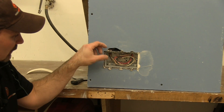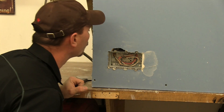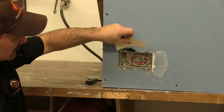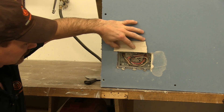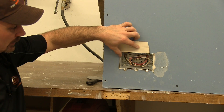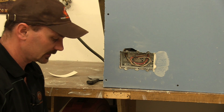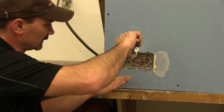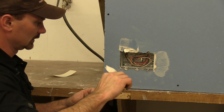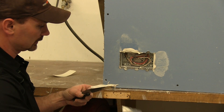Something like this that's a little bit bigger than you can typically just use some mud to fill — you're gonna have to actually apply a bit of tape to fix that area, and then later once you're all mudded you're gonna have to recut out those areas where the electrical is. Same principle here: you still want to get some mud back in there, so force some mud back into that area and take up some of that void to start out with.